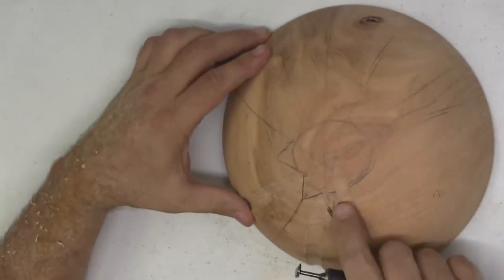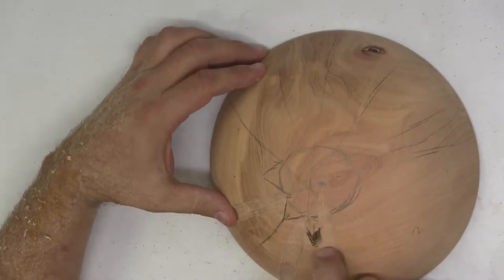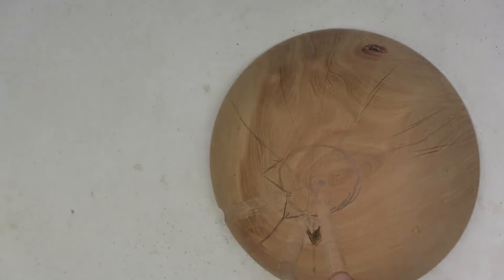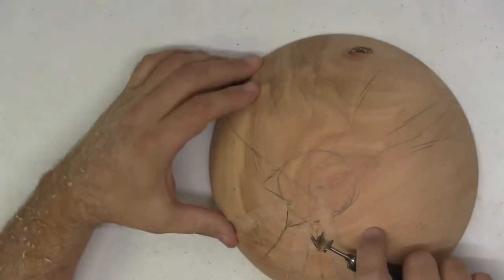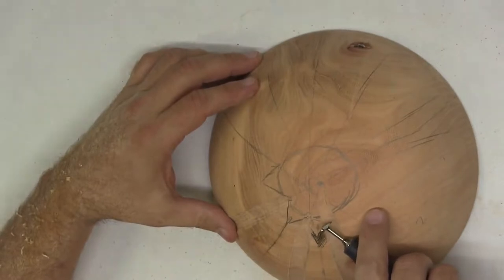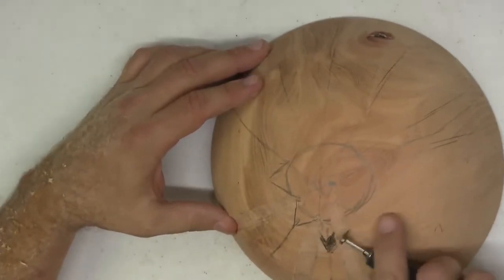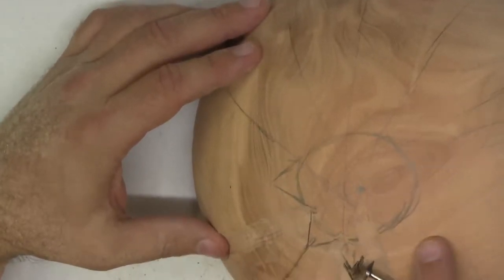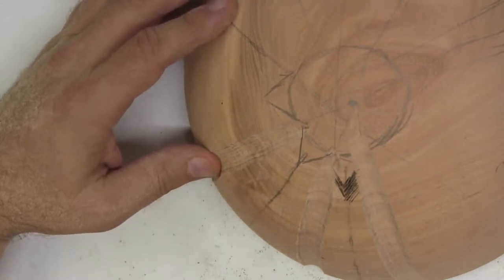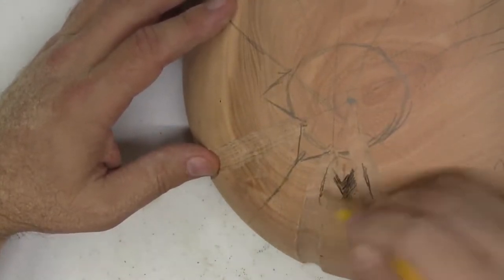You can see where I'm, if you can, is that zoomed in is good on the edge? Right now I still have a sharp edge from that radius that I cut down through here. Okay? I don't want that sharp edge, so I'm going to use this tool to carve that off, but I'm still only pulling in one direction. I can go back and forth, but I'm only going, there you go. So I'm only trying to come through here, so my goal is to come into the middle of each of these valleys.